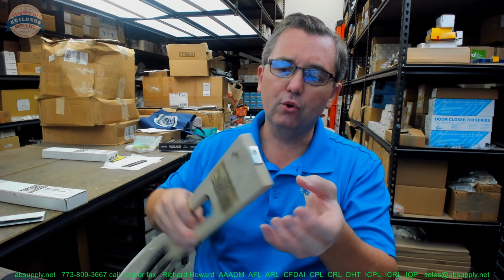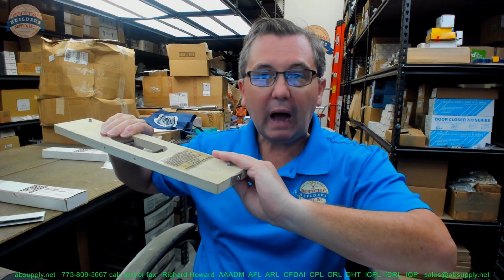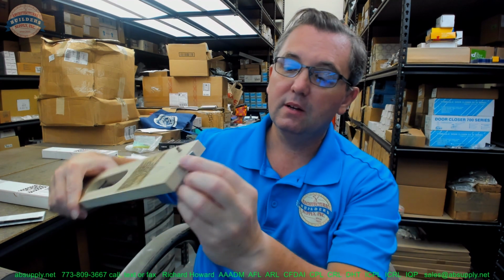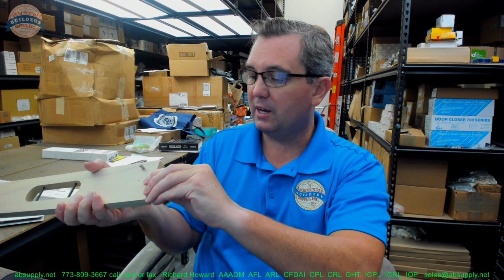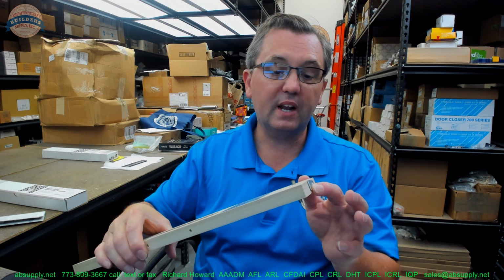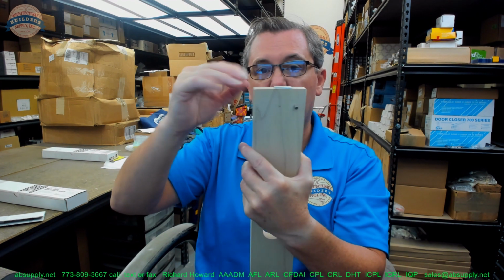That kit requires an extra groove that's going to happen over on this edge, so that the U-shaped, I think they're steel, I don't remember if they're steel or aluminum, you can attach this to the template so that you build all of your units and then move the template from the frame to the door, and all your hinge locations are automatically correct. And that's done via this little flip over tab that's here. This little flip over tab is designed, it's a bit tight, that screw, so I'd have to loosen that a little bit. You turn that down, and then you can literally just hook it on the top of your door, is how they do that. When you're doing it on the frame, you leave this in place, because that butted margin there will give you the margin from the underside of the header to the top of the door.